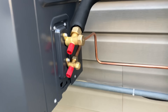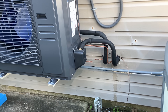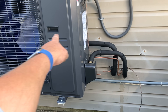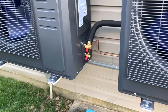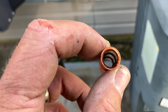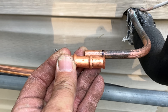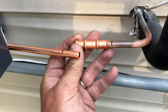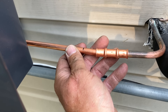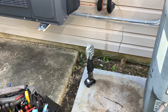Before I show you how to use zoom lock fittings — not too shabby, huh? If I would have bent that three-eighths pointing up, I would have followed the three-quarter, but I didn't. Even though this three-eighths zoom lock coupling has a little stop in it, they usually don't work. So what you need to do is mark it for your depth. I'm going to put this in right there, get the other one in, and put the three-eighths jaw on the press tool.